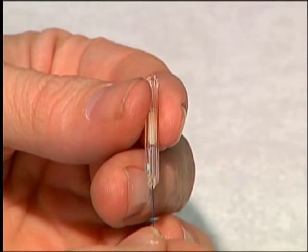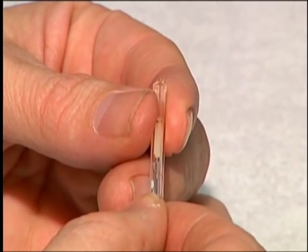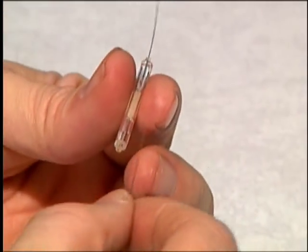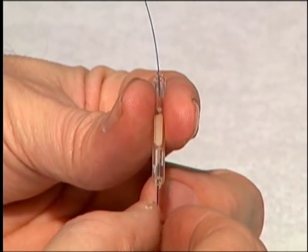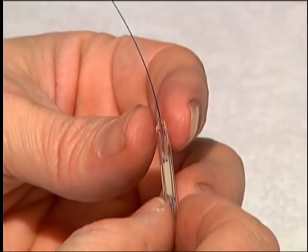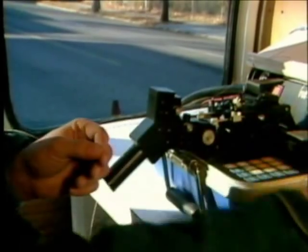First efforts included mechanical splices, which had the ability to be tuned for optimum alignment. The elastomeric splice manufactured by GTE was the first of these splice types to be used on a large scale. It was provided in two basic versions: a lab splice for bare fiber access and a field version used for in-line and pigtail splicing. As with copper networks, fiber systems would require cable splicing as well as fiber splicing.